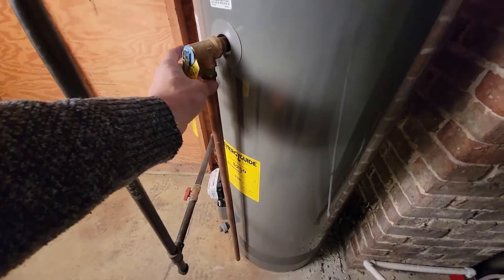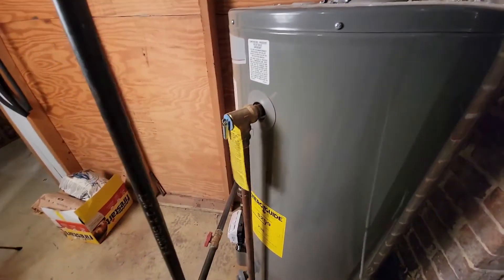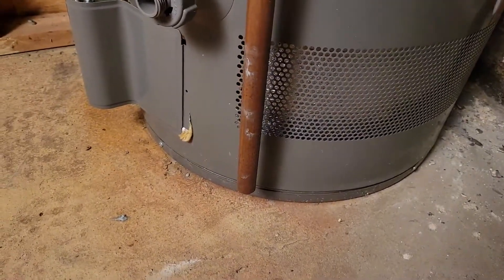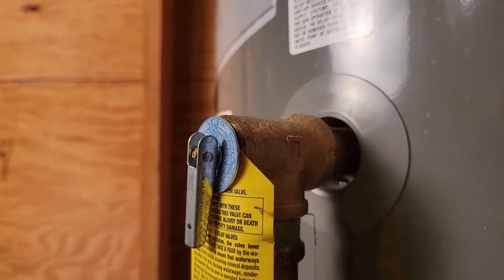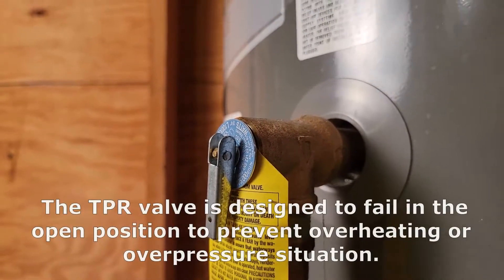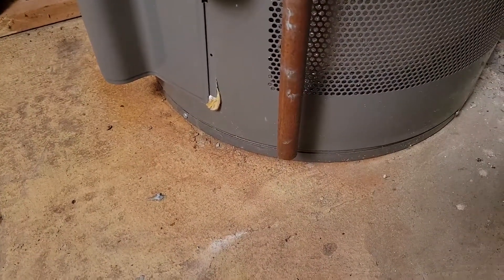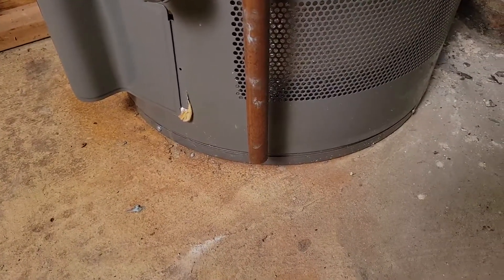What we want for this discharge pipe is metal — copper is best. Galvanized would be okay since this is not a copper fitting. If you ever come down and see water on the floor where this temperature and pressure relief discharge pipe goes, check out what's going on. It means the tank is either over temperature, over pressure, or the spring inside the valve has gone bad and it's letting water leak. If you see anything down there, call someone and get it checked out.